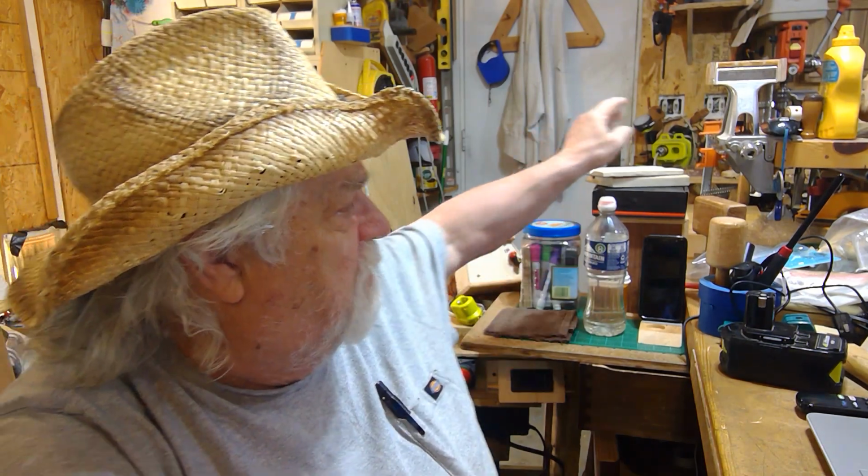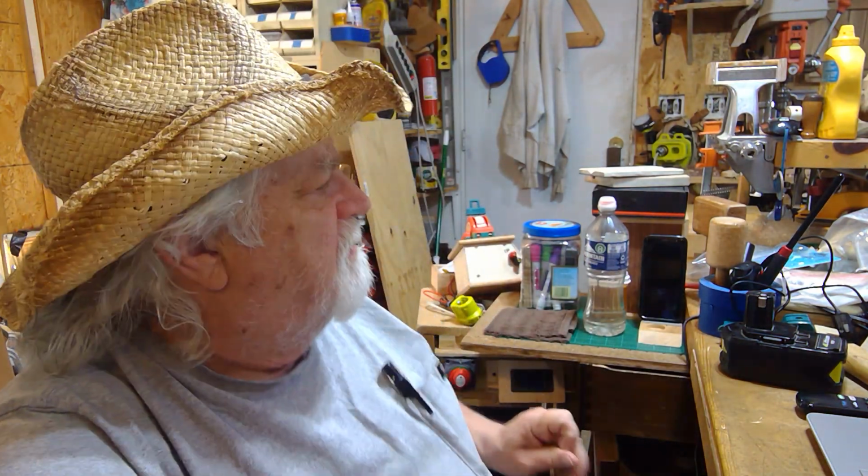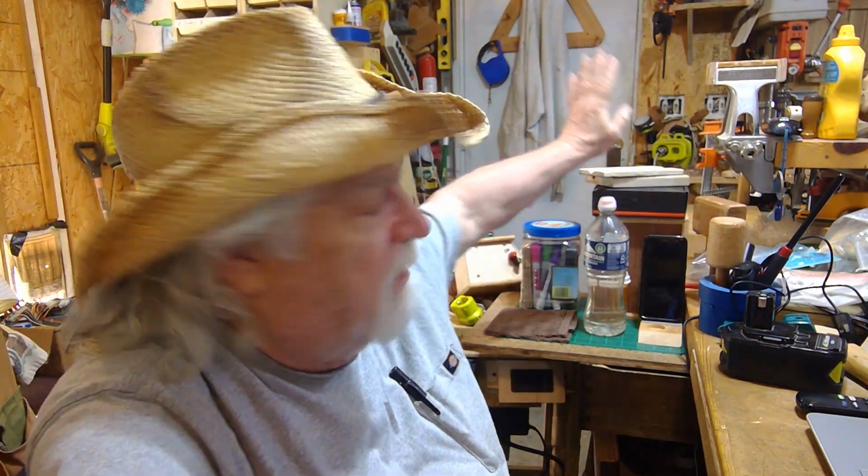Because one of the things that this unit will use is those same low voltage bulbs that I showed you how to do a Ryobi light, just quick and easy, and it runs directly. The bulb runs off of DC current anywhere from 9 volts up to 24 volts. So any kind of power source in that range will light the light bulb up. And it's not a bad little light. It's like 60 watts. And I do have a couple of Ryobi battery plug-in lights that I can grab and set up and have some Ryobi lights in the house running off of those if I need it. So anyway, that same bulb is really what's going to make this project possible too.